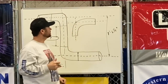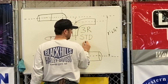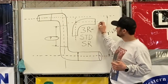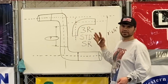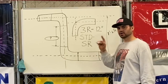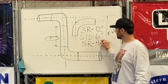There are three different types of fittings: 3R, standard, and short radius. Let's say this is four-inch pipe. On the 3R 90, the dimension from the end of the fitting to the center line is three times the pipe size — three times four equals 12 inches. Standard, which is the most common, is one and a half times the pipe size — 1.5 times four equals six inches. Short radius is whatever the pipe size is — for four-inch pipe, that's four inches.